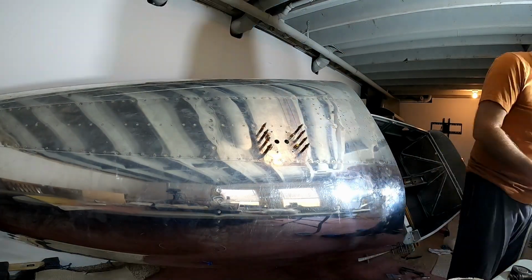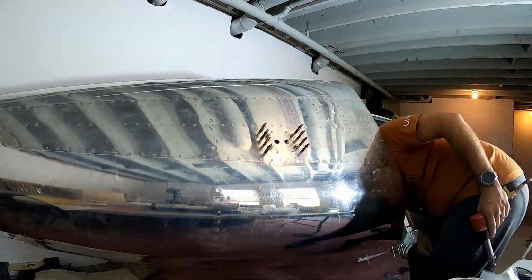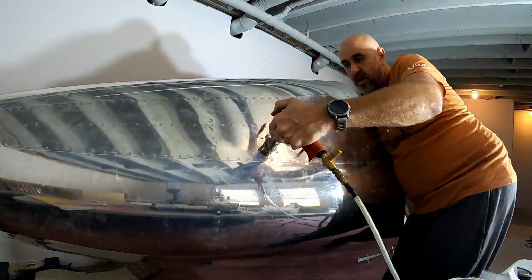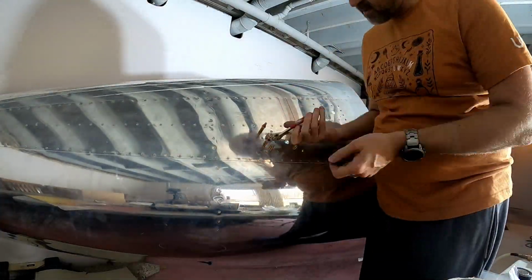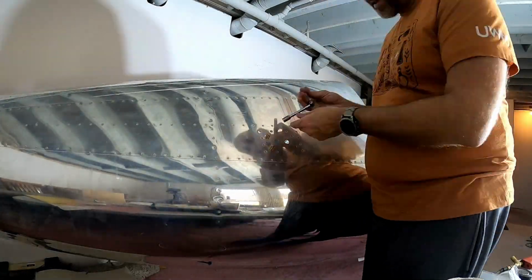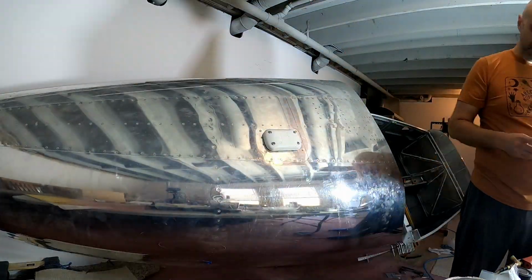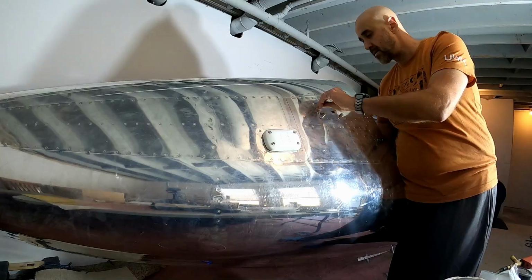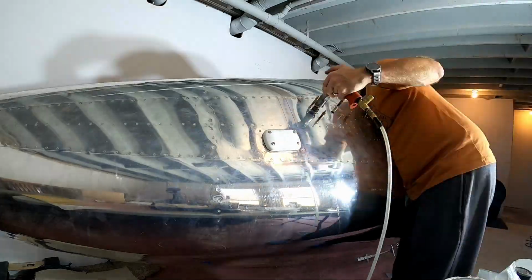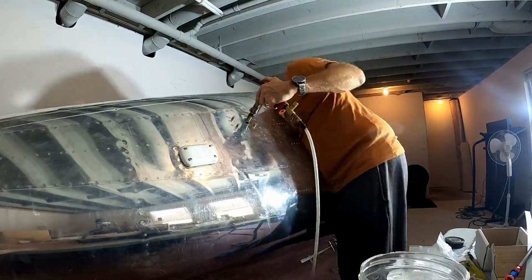This was fun. You need to put a doubler in, and you can't put rivets or clecos in the center. I just take some AN3 bolts with a bunch of washers and tighten it together on the nut plates with the bolts. Use them as temporary clecos. So there you go. This is the 57X getting its install. We're going to go through the same thing with a doubler for the GA36, and then I don't know if I install it here. I guess probably do, because there's not much left to do.